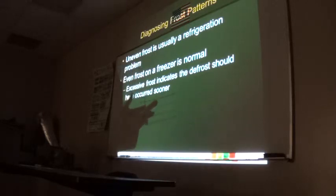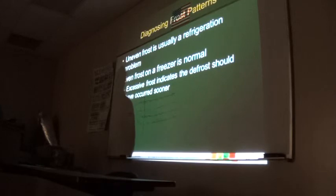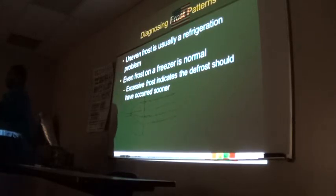What it does, that vinaigrette fumes, because it's citrus base, it's vinegar base, it's oil base, it's every single thing that's bad for you. So it's highly acidic. It chews away at the aluminum first, then the galvanized, then it begins to attack the copper. So I find a lot of pinholes in these things, and you gotta end up changing them.